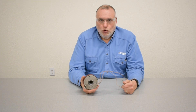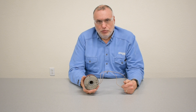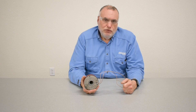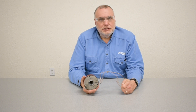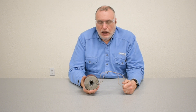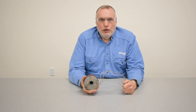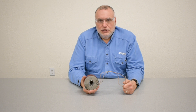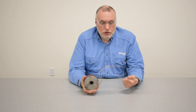Also, the control board supplies voltage to the brake. On the normal 460 volt chain hoist used in the US, the brake voltage supplied is 216 volts DC that comes from the control board. You can unplug and check at the time of functioning if the 216 volts is being supplied to the brake plug.